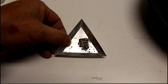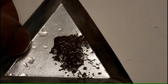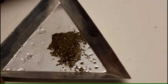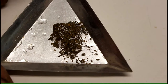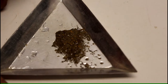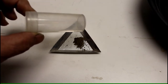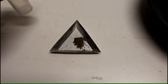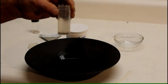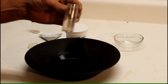I've put our gold in a little tray here so you can get an idea of what it looks like. As you can tell, it's not very good-looking gold — it's real dark from the acid. So now we're going to clean this up. I've taken it out of the glass bottle and we're going to put it into a plastic bottle. You do not want to use glass for this next process — make sure you use plastic. Now we have all our gold in the plastic jar, and we want to pour all the water off.